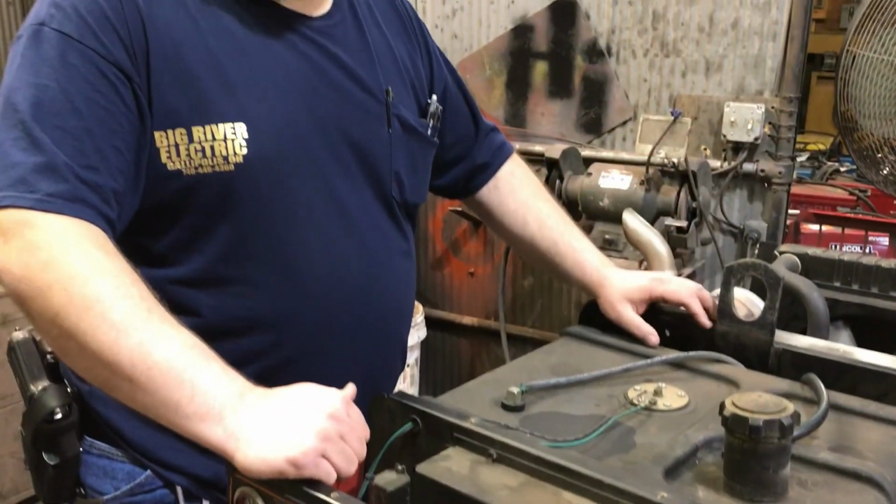As you can see, the machine pulled almost 300 amps on the load bank. It's rated for 250. Replacing the injection pump solved the machine's issue, thus saving the customer thousands of dollars as opposed to replacing.